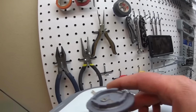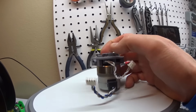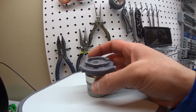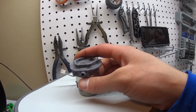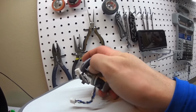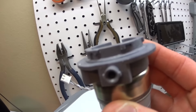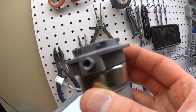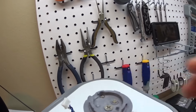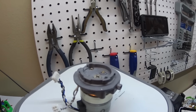You could hear the motor grinding, and if I came in and I pushed the filament through, then it'd start catching again. But there were a lot of times where I push and it just was not moving any further. So I ended up having a plug of filament stuck in here, and I couldn't even see through there. I don't think you can see that, but I had to drill it out, and everything seems to be working fine.